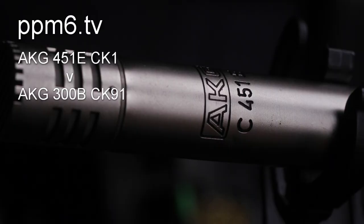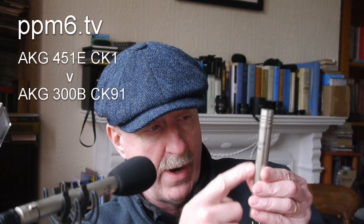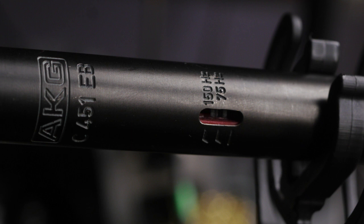I've got one here and we're kicking off with the 451E, which is I think the first version — there may have been a 451 without an E but I don't think I've ever seen one. This one noticeably has no filter, no bass cut on the body of the preamp, whereas if you compare it to the 451EB you can clearly see there's a little switch on there. I'll do some nice close-ups and drop them in through the video as we go along.